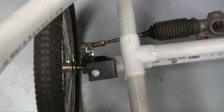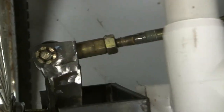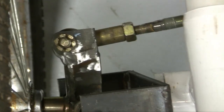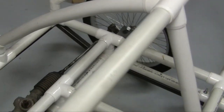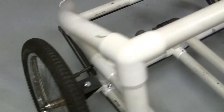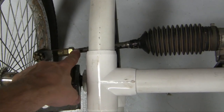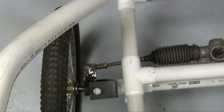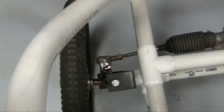If we zoom in on the spindles, you can see I had to redo my spindle tabs. I had to move a little L-shaped piece there so my Ackerman would be correct. What I did is I took the spindle off the left wheel and put it on the right and vice versa, and mounted my steering rack. When I did, I had a reverse Ackerman because this point here was actually here, and it didn't work out. So I had to redo that for the front-mounted configuration.